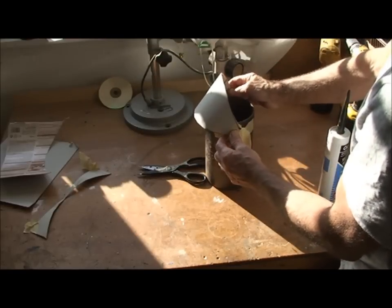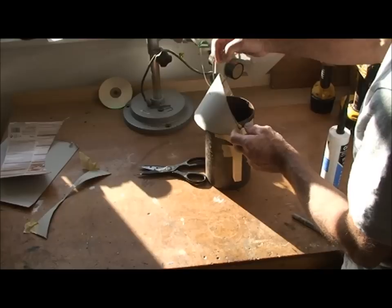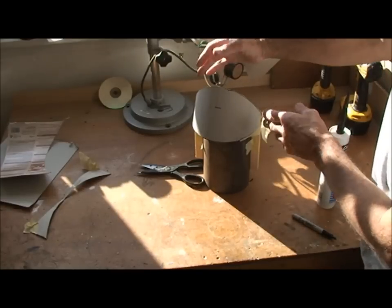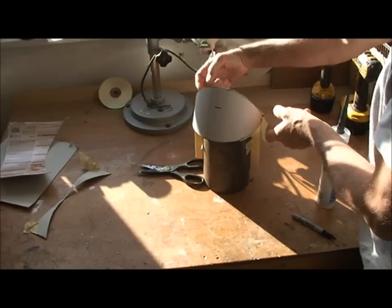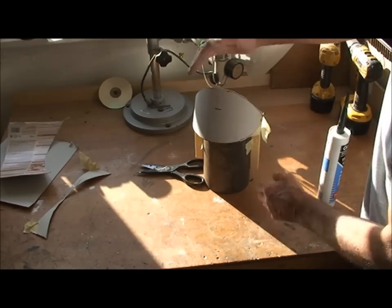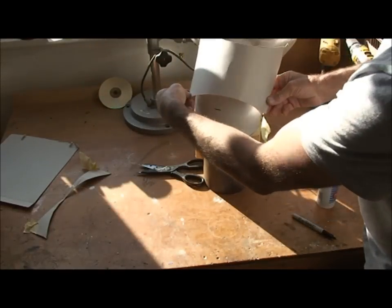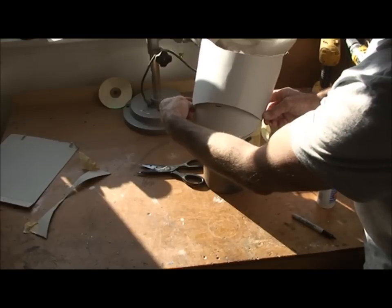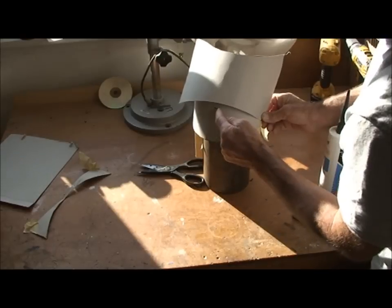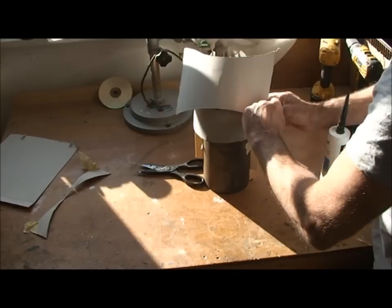Approximately 50 degrees, as I say. You then make another one and mount it so that it's lipping over at three and a half inches — that's your second one. The second one will have to be a little bit longer on the length, just to bring it out, because you want a three-quarter-inch gap at the front edge where the next one bends over. So it's tight on the sides with a three-quarter-inch gap there, and three inches up to there.